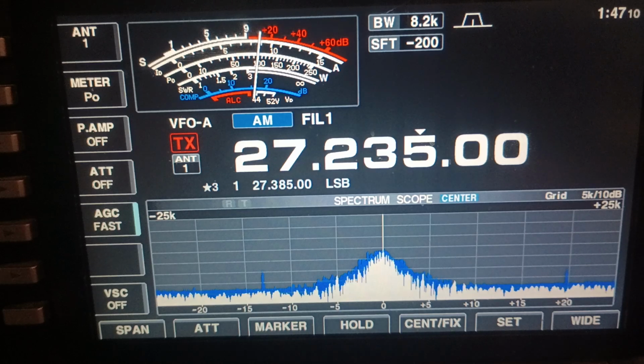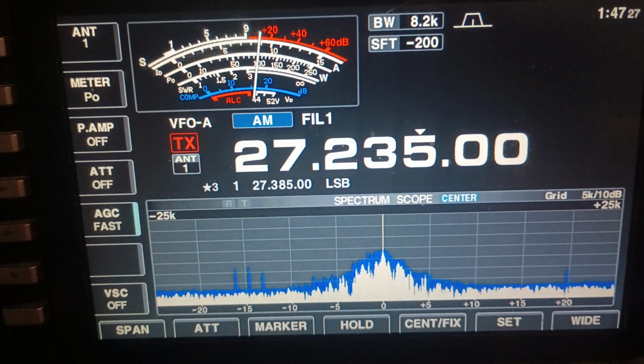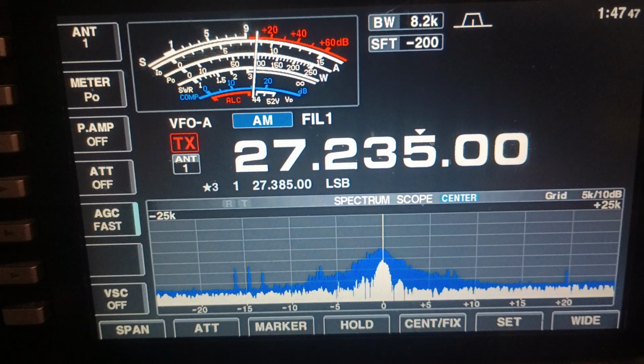Hello, audio. All right guys, this is actually a Uniden PC68 LTX, and I'm going to go ahead and turn the mic gain up on it a little bit. Hello, audio. Okay, now we should start having a little bit of audio in there. That's with the mic gain at about 2 o'clock on the Uniden 68 LTX. And we're running about a 2-watt dead key right now. Audio, and we're swinging about 10 watts average, 35 to 40 PEP. Now, you guys have seen me use this one on the test bench some before.